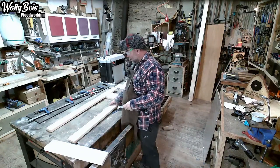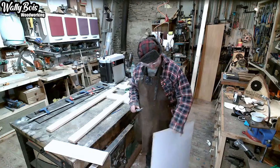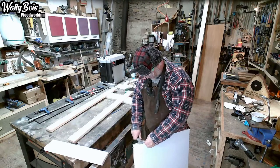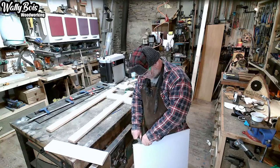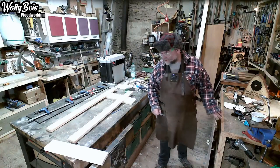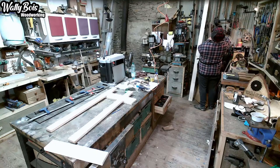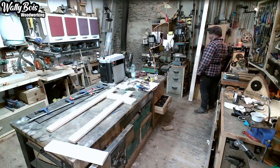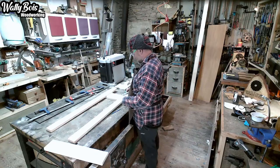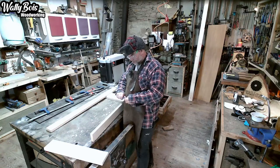So, this panel that's going in there, I've got the thickness of the actual panel itself. It looks like it's some nasty MDF stuff. About 9 millimeters thick, but then also I want to put a backing board in, even though it isn't quite wide enough, so we'll bodge that up to suit. So that was 9 millimeters. How thick is this? This looks about 3 millimeters. So that's 12 millimeters. To allow for any movement, and we don't want it tight, I'm going to do it 13 millimeters. We need a slot in here. It's got to be 13 millimeters wide, which is literally that.